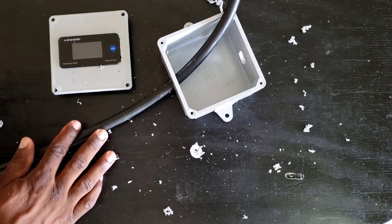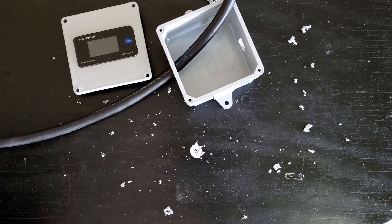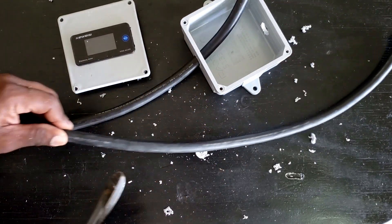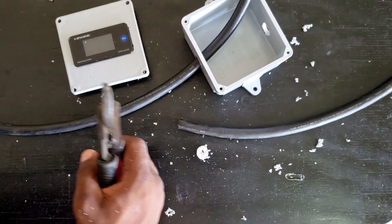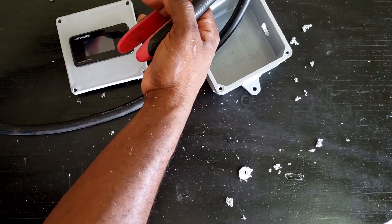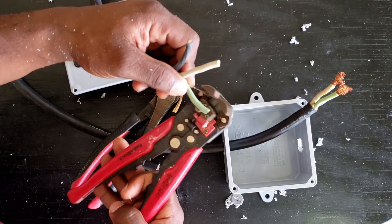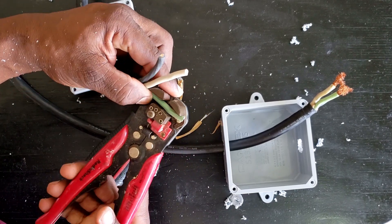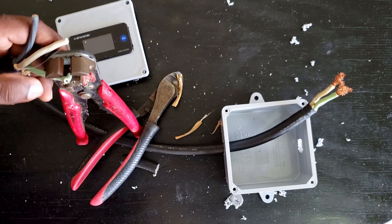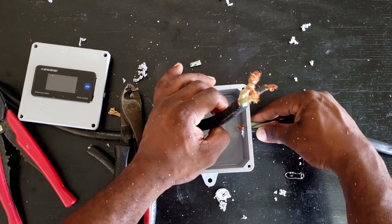I'm not going to make this one too long — just going to cut it right here, just enough to get to my extension cord, because this one's going to be used on the extension cord on the inside. Cut your cable, measure the same length, cut it again. Go ahead and strip up the ends just like this. This is where you're going to put your plug — whichever one you decided you want to use. I'm going to do the 30 amp. Once you strip the other side, tuck it in like this.